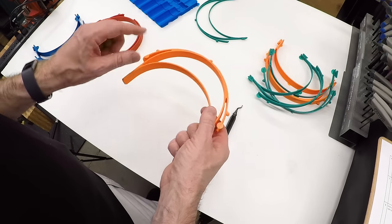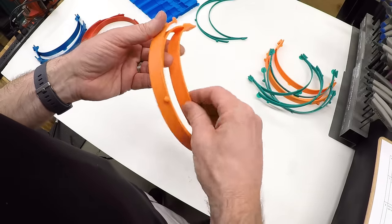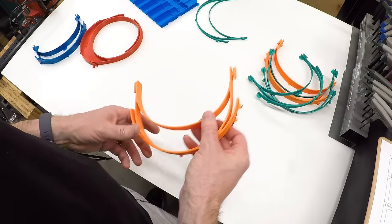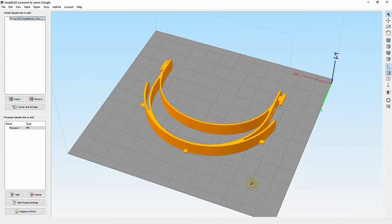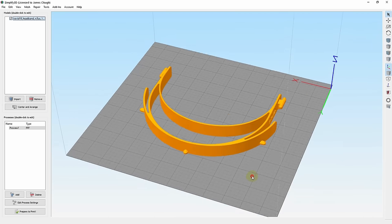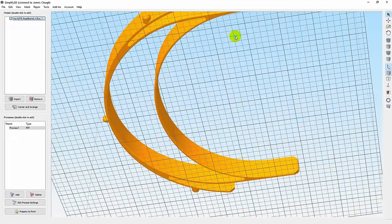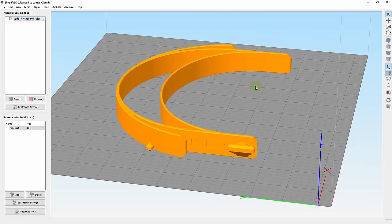Putting mouse ears on is not obvious how to do. You could modify the STL file, but generally you don't even have to do that. Let's pop into the computer and open up Simplify3D, and I'll show you how I add these mouse ears. This is my slicer — Simplify3D — and I have the part pulled in here. This is the Prusa RC3 US version face shield headband. The reason I have so much trouble printing it is that the surface area that actually sticks to the bed is really narrow. There's some area up in here, but back here there's just nothing holding it.